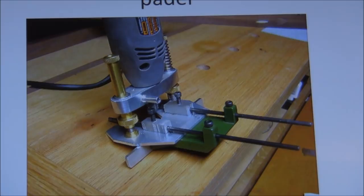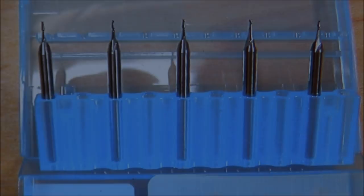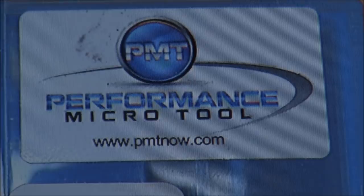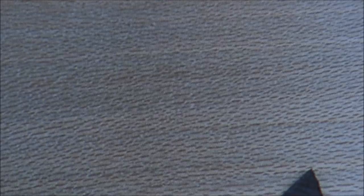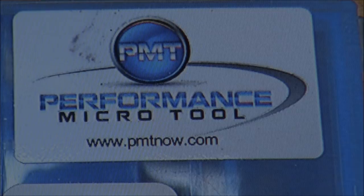This is a Stewart McDonald Dremel tool router — I've converted it to hold a fence. Somebody in here is about to do some purfling — that's what this thing is for. The little router bits: I use them for everything, but if you're pattern routing, you have to have those. I recommend 1/32nd-inch stringing because it just looks better. You can buy these bits from Performance Micro Tool. They're about half price compared to anywhere else, but you have a $50 minimum. I recommend buying 1/32nd, 3/16th, and 1/8th — that'll bring you up to your $50.